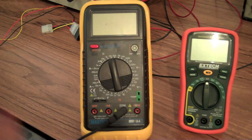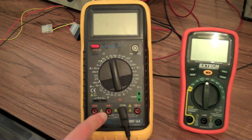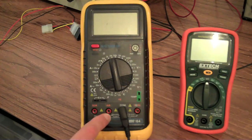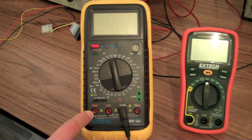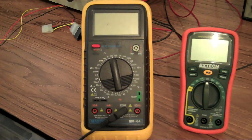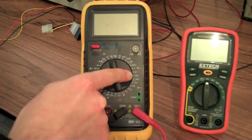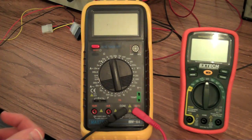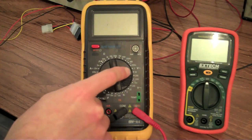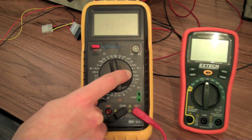If you need to measure a current in excess of the 200 milliamp limit for the milliamp jack, you want to use the 10 amp port, otherwise you're going to blow the fuse in the unit. Also, if you exceed 20 amps for 15 seconds max on that port, you'll blow up the multimeter — important things to keep in mind. Since we're going to be measuring voltage, we'll connect the red probe over here. You have your DC voltage measurement settings and different scales. Because we're looking for around 12 volts, the 200 millivolt scale is not appropriate, neither is the 2 volt scale — we want the 20 volt scale.